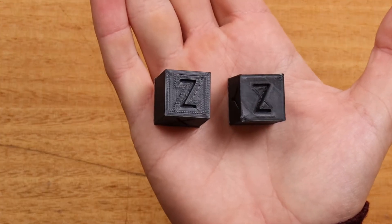Both models were printed on an Ultimaker S5 using tough PLA with a fast print setting. The default parameters function quite well and it works consistently with common filament types. Ironing has huge potential and I see no reason not to use this feature in almost all 3D prints where aesthetics and excellent surface finishes are required.